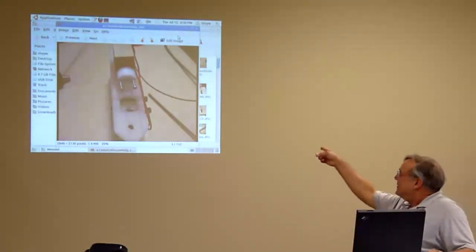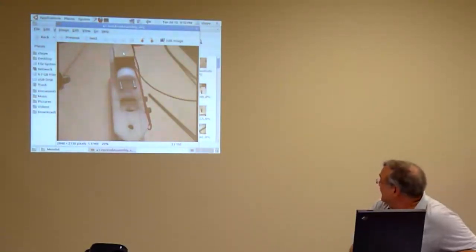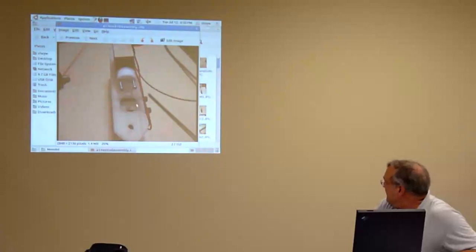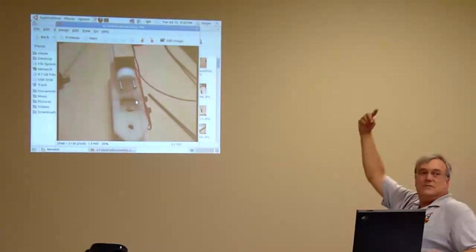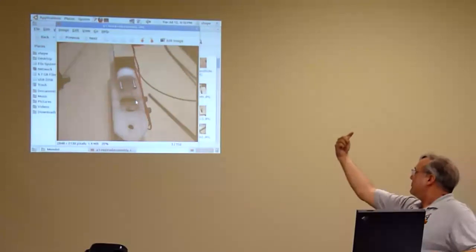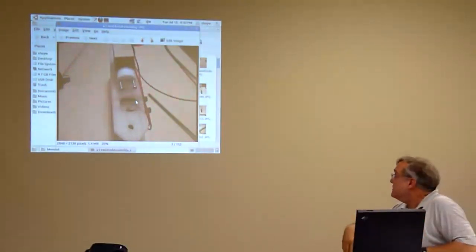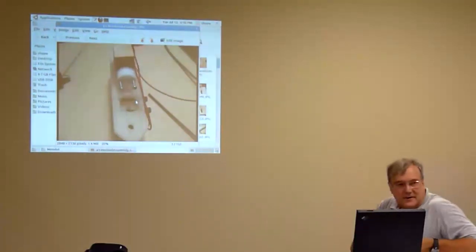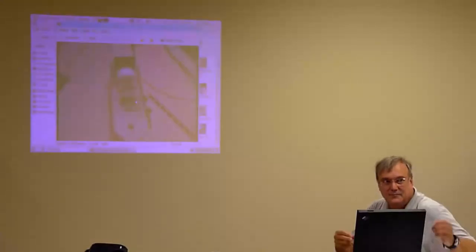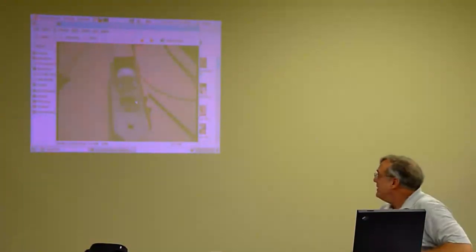This little piece right here took me about 2 days to figure out, and in fact, this little part right up here at the top is what broke over the weekend. This is upside down, but this is the part that moves back and forth across the x-axis. The filament feeds in up through the bottom, then through that little white plastic ring and comes out the nozzle on the other side of that wooden piece. I had all these pieces, but I didn't know how they fit together. I'd seen one at the shows and knew more or less how they worked, but I'd never seen all the details of how things fit together inside.